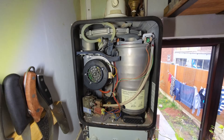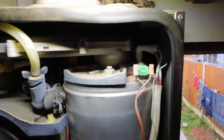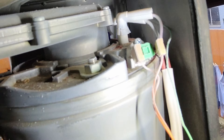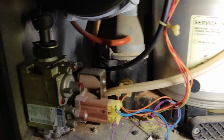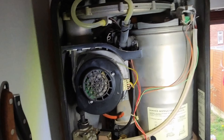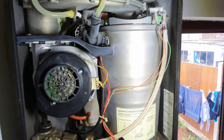The red gasket is completely split - look at the state of the electrodes. The insulation on them is completely burnt out, and it's furring up in there. This boiler has been leaking badly. The case seal is still intact, which is the only thing that stopped it from spilling out. I can't see a seal anywhere, but I think the fan is probably the least of their worries.